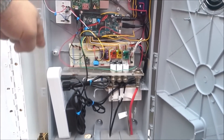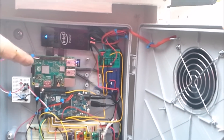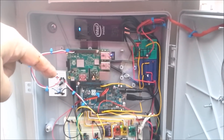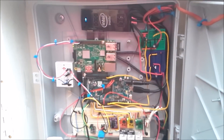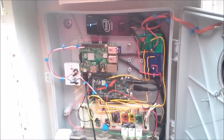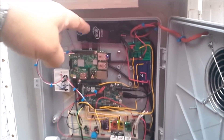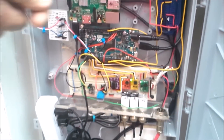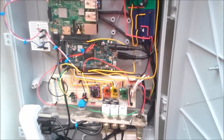Really what it comes down to is you have an Arduino that gets the information from the various sensors and passes it to my Raspberry Pi, which has a database, Apache web server, and PHP scripting language. It puts all of that in the database and it's also connected to the internet so I can view the acidity level and so on. On top I've got an Intel PC stick that lets me remotely connect and program all of these devices, update the firmware, instead of having to come and connect my laptop each time.